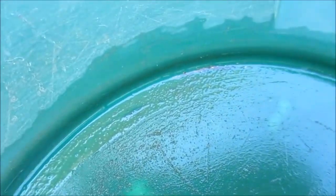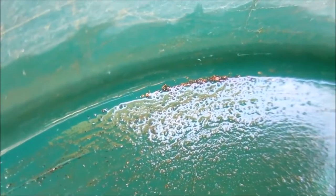I'll go in the shade — you might be able to see it a bit better in the shade. It's not much, but there's gold in the sulphides. I'm going to treat some more sulphides; the sulphides are in the tailings, I've got to redo them. I'm going to try and cupel them — that's melt them down — to see if I can get the gold that way. This is the gold under a jeweller's loupe; you can probably see it a bit clearer. That's very fine gold, very fine, but that's what I've got out of the sulphides.